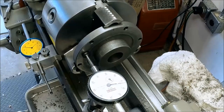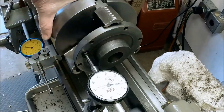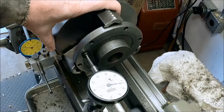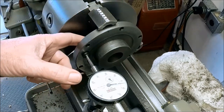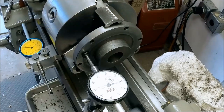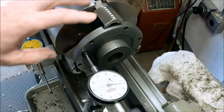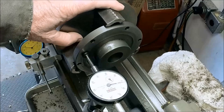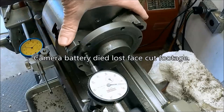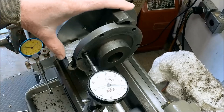My other thought on how to set this up was to use a face plate and leverage these holes to bolt our back plate on. I'd have to have some spacers, which I do have, because we have some protrusion here on the spindle mount. I rummaged through all my metric fasteners — I have quite a few but I could not match this thread. It's a relatively coarse metric thread, and I don't want to use the ones that came with the chuck and risk damaging those.